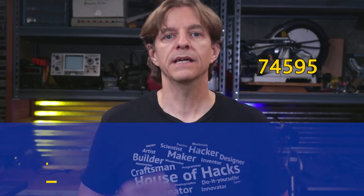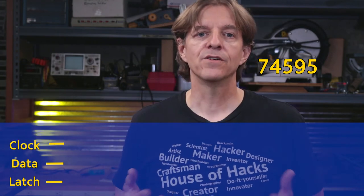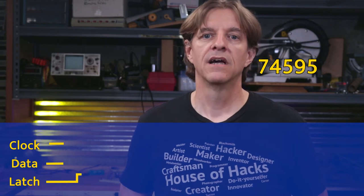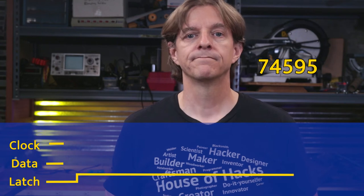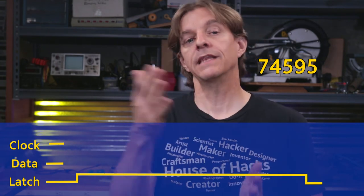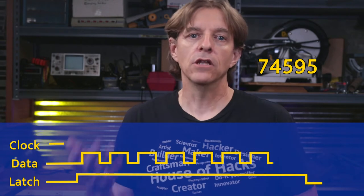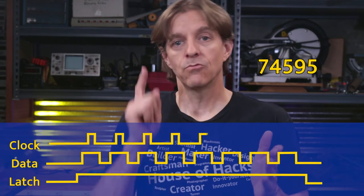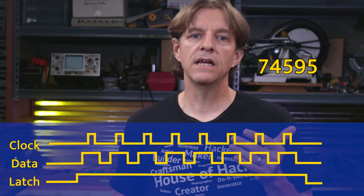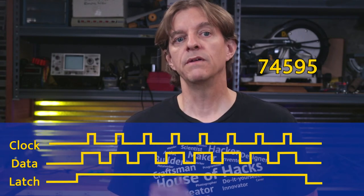These chips connect to the Arduino with just three pins — that's the serial in part. The three input pins are called latch, data, and clock. First, the latch pin says get ready, we're about to make some changes. We set it whenever we want to change the contents of the register. We then use the data and clock pins to actually set values, and then unset the latch when we're all done. When unset, the values put in on the data pin are transferred to the 8 output pins. The data pin says this is one value to display — it can be thought of as high or low, on or off, or one or zero. Finally, the clock pin says take the value off the data pin right now. This is because there can be a transition time when the data may not be fully on or fully off, and we really want to make sure that the data value we're using is the value we want before setting it on the chip.